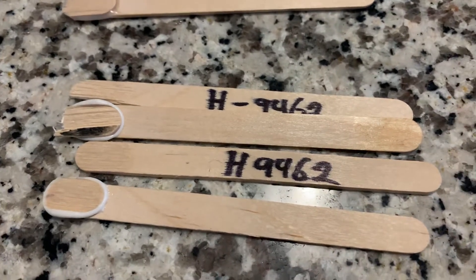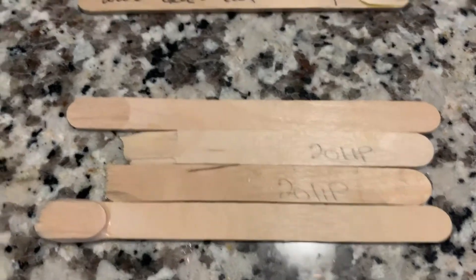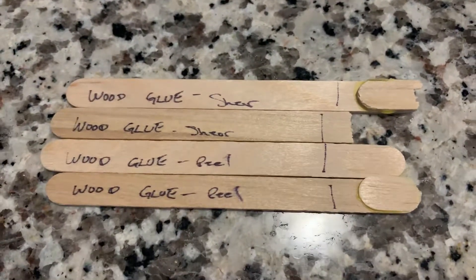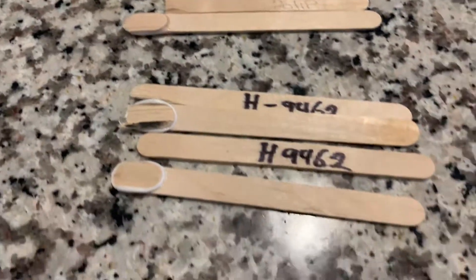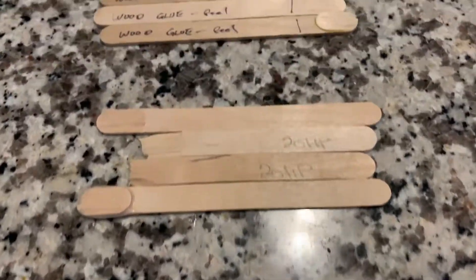Based on the results, I would definitely go with the Hysol products. I'm very astonished by the wood glue results. However, I would not use wood glue on things like carbon fiber or fiberglass — I will be running further tests on that. What I really wanted to assess for peel and shear strength was carbon fiber and fiberglass control horns. Thank you for watching. Hopefully these results show a little more evidence to the ongoing discussions online about what to use to build RC models. Take care.